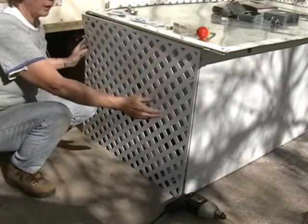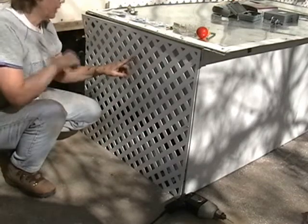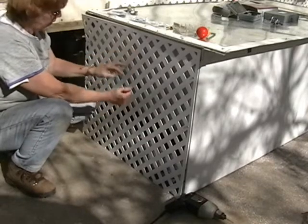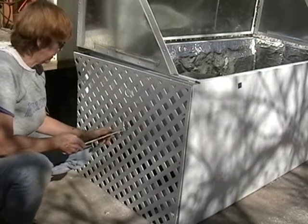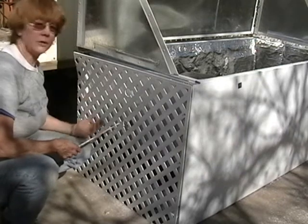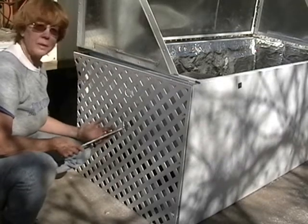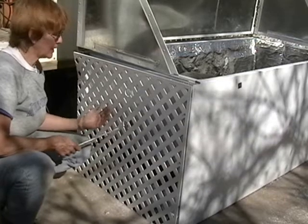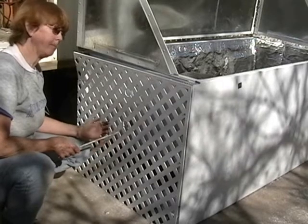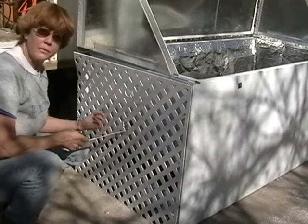You've got to hit the frame where it gives you a frame to hit. Now I've got to get in and get the keyhole saw and drill holes so I can bring through my piping for the hot and the cold. I don't want my pipes running out to interfere with my access to the water closet — for example, sometime down the line when I get my conventional water heater hooked up with the bread box. But since I use shark bites, I can disassemble the piping, turn the water off, and get them out of the way. But I'd really rather just leave them as they are, so I think we'll have them come into the side of the box.